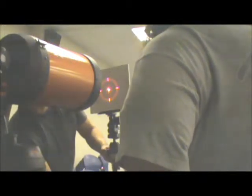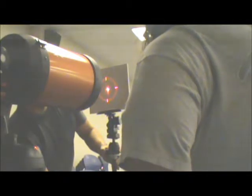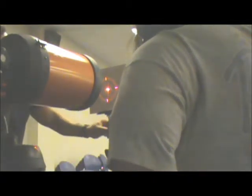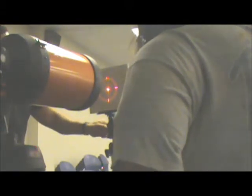My understanding is that the primary optical axis is squared up to the collimator. Now we will install the reflector mirror in the focuser to align the focal angle. The reflector mirror represents the focal plane of your final optical axis, so it is critical to load it properly.